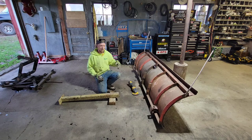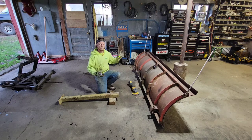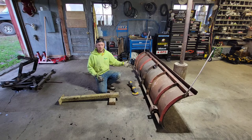You can raise it and lower it. We're going to have some safety chains on the top to secure it onto the bucket so you don't drop it off. Next step, we're going to cut up some pieces of this square tube, get them welded onto the back of this blade. After that, we're going to get the skid steer in here and lift this thing up so we can do the rest of the work.